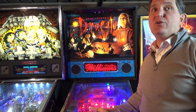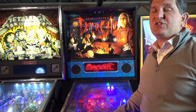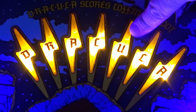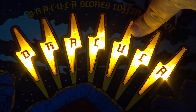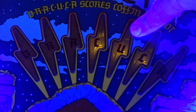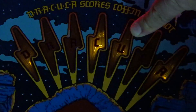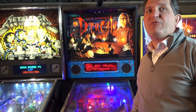I'm going to show you what ghosting looks like with standard LEDs in this Dracula machine. The LEDs are ghosting a little — when they're supposed to be off, there's just a very faint flicker. Typically you don't see ghosting when LEDs are used in general illumination, which are lights that are on predominantly and not controlled by a chip.